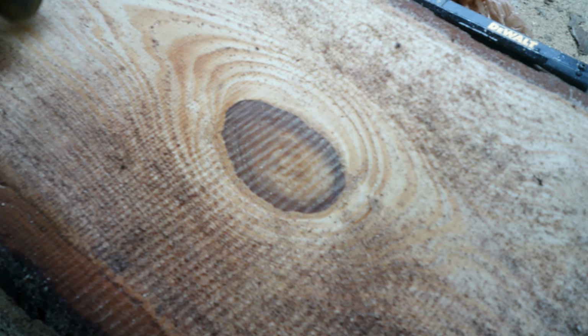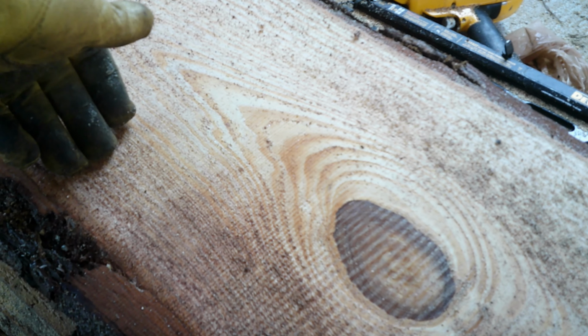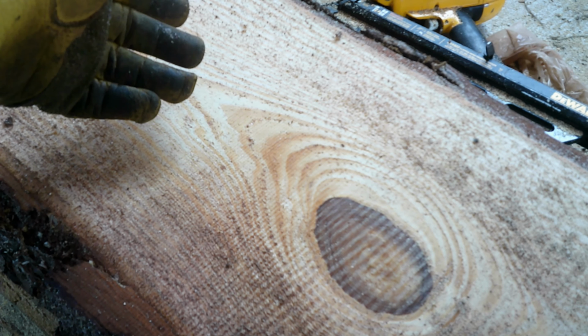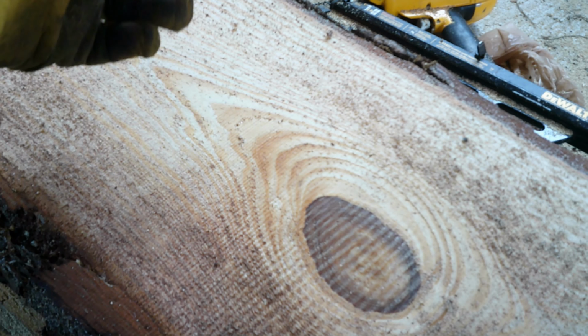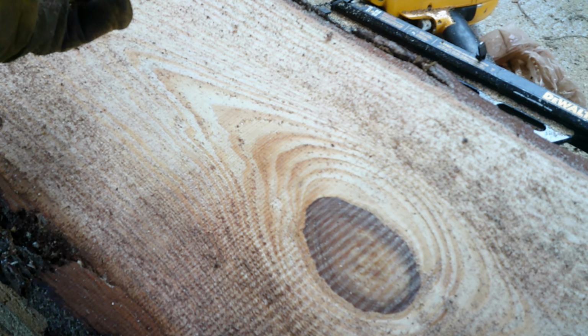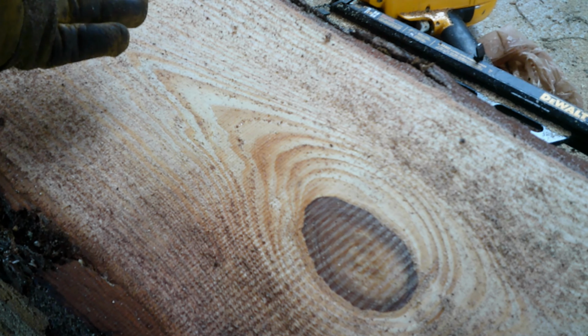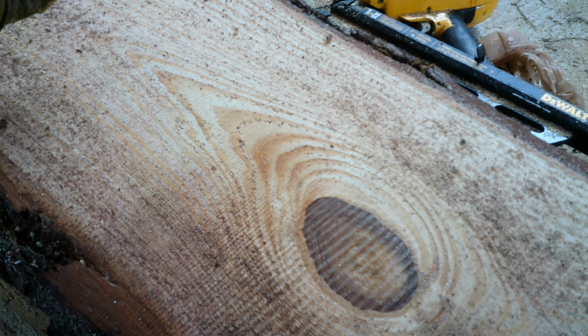or if it's in just straight grain wood, like if it was right here, what that would be is the head is actually running too slow. Whenever it's running too slow, the wood ends up caking up on the inside, causing the blade to start chattering. And that's what you end up getting that sound from.